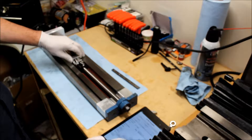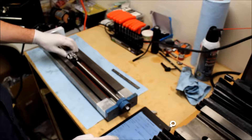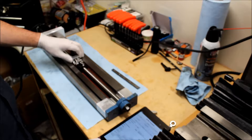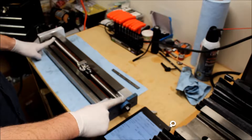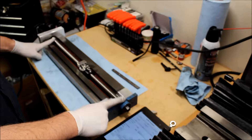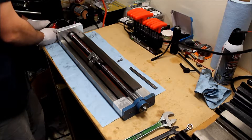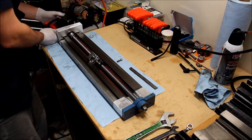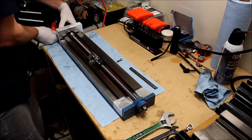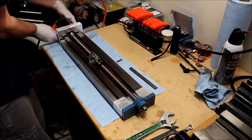Something is definitely not right. So the question is: what is generating the wobble? Is it this end out of alignment, or is it this end down here that's off? We'll have to figure that out. First thing is we'll take off the motor end and take a look at the coupling assembly - see if there's something out of alignment there or if it's the motor itself.